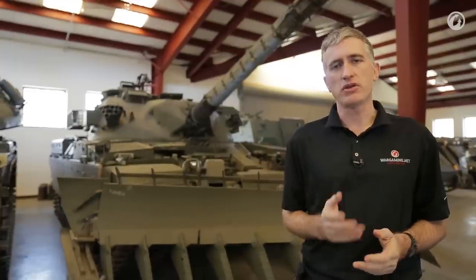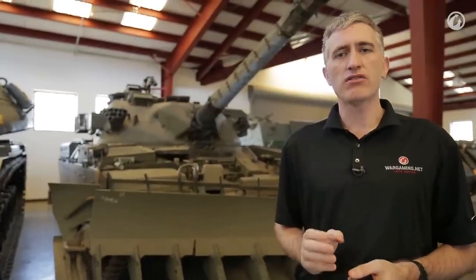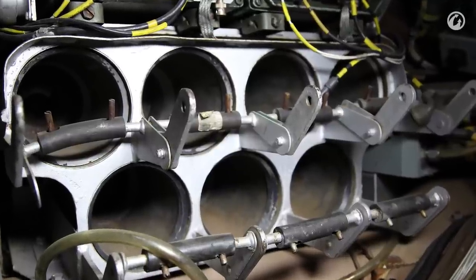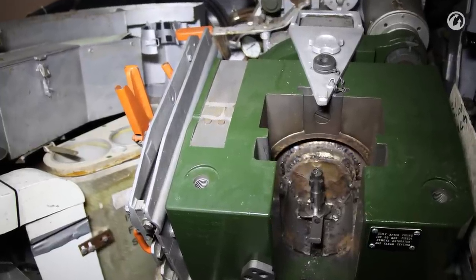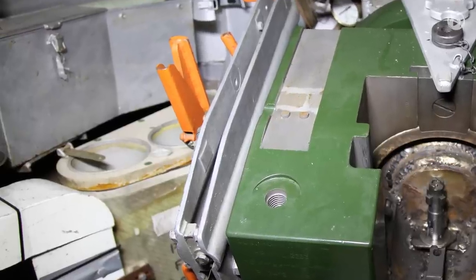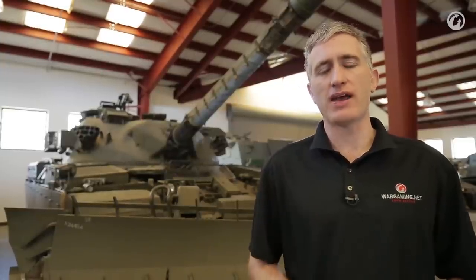The rounds are three-piece ammunition. Everybody thinks of them as two pieces, but technically it's three. The first part is the projectile. Inert rounds like armor-piercing are scattered around inside the turret in the bustle, close to hand. Explosive rounds such as HESH are stowed in a safer position below the turret ring. The next part is the propellant charge — these were bagged charges, and the entire charge would be consumed. They were stowed in armored bins within reach of the loader. The third part was the vent tube, which looked a lot like a .50 caliber blank round — basically the primer. They were fed through a ten-round magazine, so the loader generally only had to load the projectile and charge, arm the cannon, and his job was done. Every tenth round he would have to change the magazine out as well.